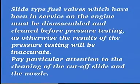Slide-type fuel valves which have been in service on the engine must be disassembled and cleaned before pressure testing, as otherwise the results of the pressure testing will be inaccurate. Pay particular attention to the cleaning of the cut-off slide and the nozzle.